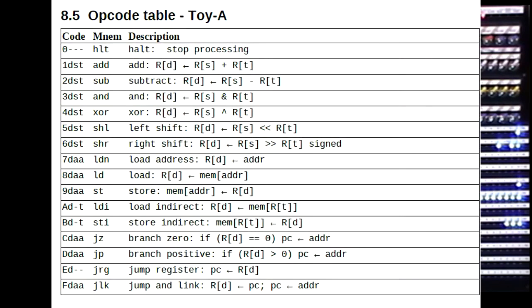Now, you may have spotted a catch-22. Treating each digit separately still means you have to multiply them. But we haven't got a multiply function. Well, the trick is that the digits in this case are binary, and it works out that the only multiply operations you need are powers of 2, which, if you remember from a previous video, is the same as shifting the binary number to the left. Shift 1 place to multiply by 2, shift 2 places to multiply by 4, and so on. And as luck would have it, we do have a shift instruction. So here we go.